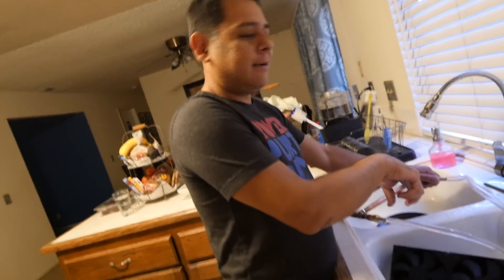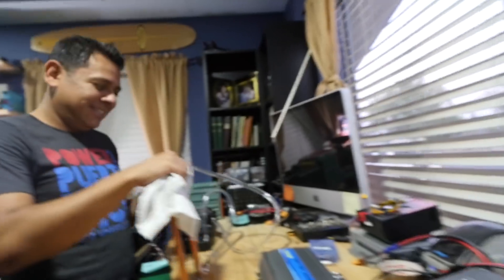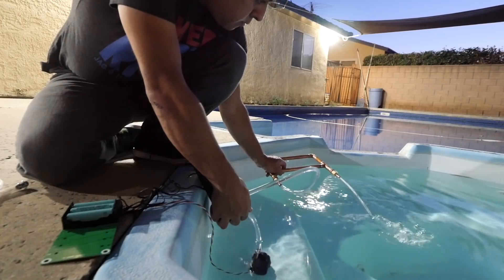The easiest way is to put it under water — the one that's sucking in — and then let it just roll, and then you just connect it underneath. Put it in a pot, whatever. It's got water. There's a lot of air — look at that. So it's leaking — one of these fittings here. Where's it leaking from? Right here. You put pressure in it and then you flip it around and there it is. Nice.